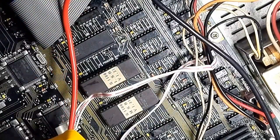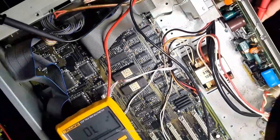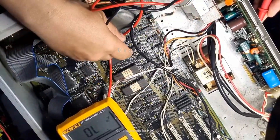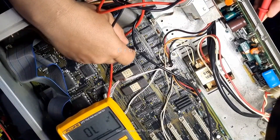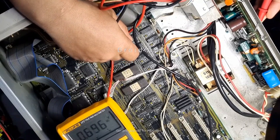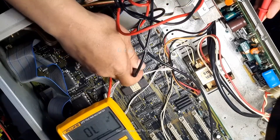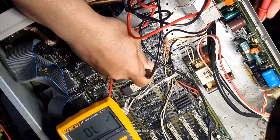Check this — pin 1 is earth, pin 2 gives 0.6. I'm on the pins now going through each one. We're getting 0.6 diode drops — 0.6, 0.6, 0.6 — lovely, consistent 0.6 readings across multiple pins. Watch this one...